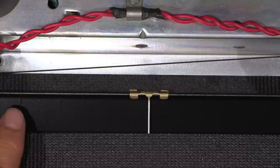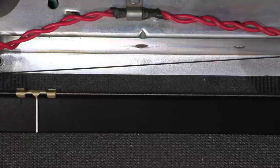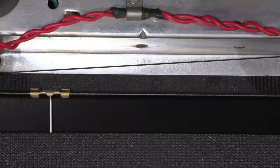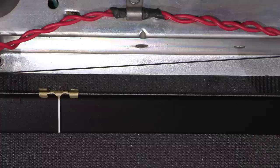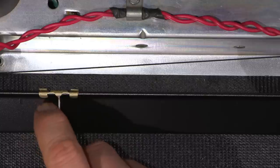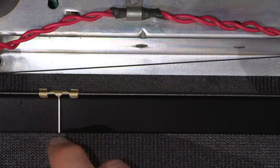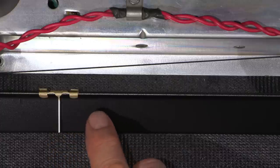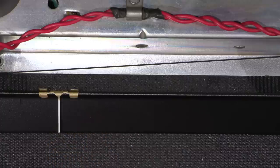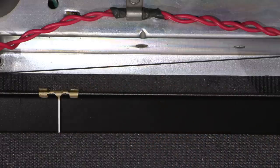So again, here is that bottom alignment point. You can see that right there. Let's move it right down here. It's right there, no problems. So I don't even need to move that. There's another alignment point here for the oscillator, and so on and so forth at the upper portion here. I also put another little coating of white on the needle here. What you see that isn't white is out of the viewing angle. You can't see that. So it's just this area. It's a nice bright white needle now on this black background, which will make this look very, very nice behind that little piece of dial plastic or that little light pipe.